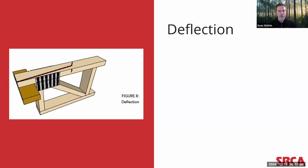So by considering all of these different failure modes in ANSI TPI 1 2022, the maximum allowable reactions for these top chord bearing or extended chord bearing trusses can more accurately and reliably be determined by the truss designer, which allows for a much greater range of configurations of top chord bearing trusses. And for building designers, this is great news, because it means that this versatile tool that they have in their arsenal can be used in more varied applications going forward. So it'll provide greater versatility and greater value for building designers.